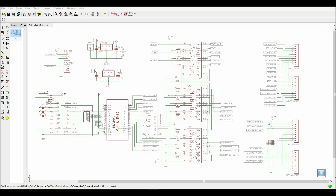So the idea with this solution is to take the 10-pin connector that goes to the 6 buttons and the display, and actually plug those into my own controller, which I can then interface to the Arduino Nano, and then take the outputs of that and send that back to the coffee machine's default controller board. The idea being that there's no modification required to the coffee machine, no soldering of pins to buttons and that kind of thing. From the coffee machine's perspective, nothing has changed.